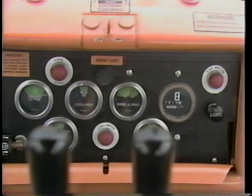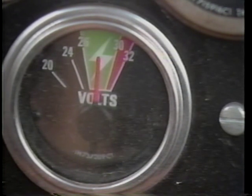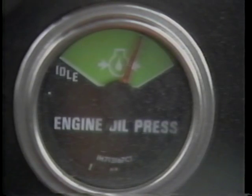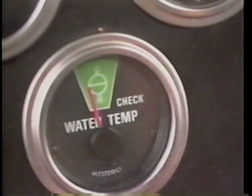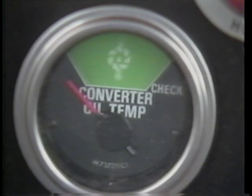The panel gauges give information about the engine performance. We can look at these gauges individually to make sure they are operating in their normal ranges. Does the amp meter read on the positive side? Are the oil and hydraulic pressures in the safe zone? If equipped with a fuel gauge, is the gauge functioning and is the fuel tank full? Is the engine temperature gauge reading in the safe zone? Is the transmission pressure or temperature gauge in the safe zone also?